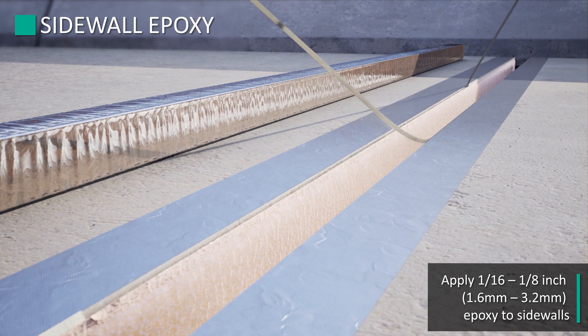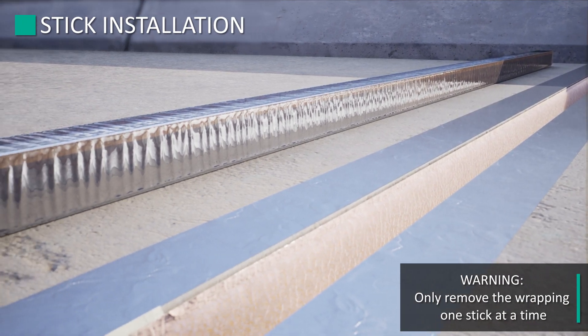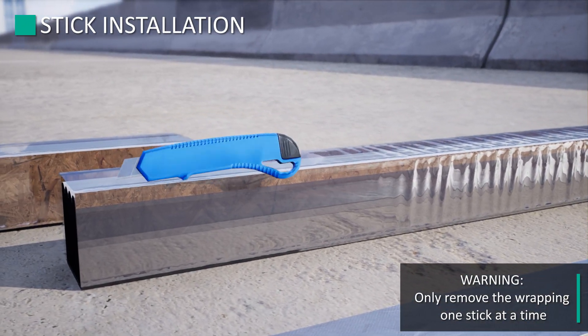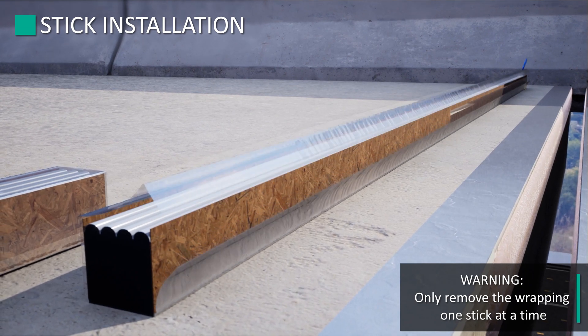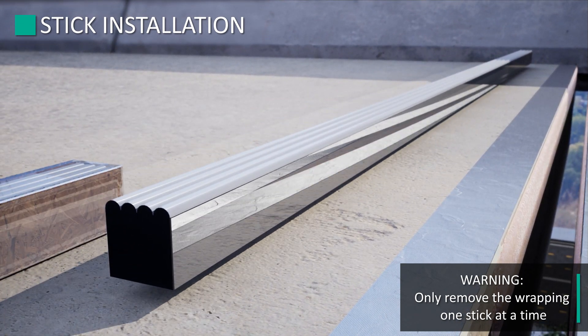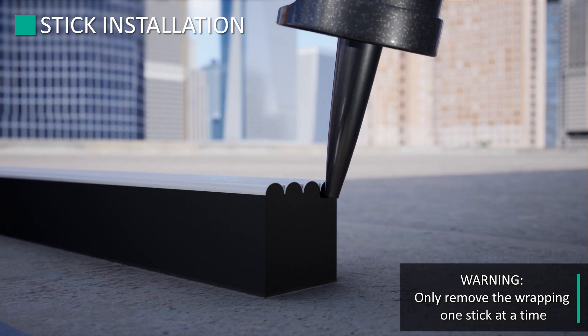Remove the quarter-inch tape from the inside of the joint for the length of the first stick. If the epoxy hardens on the surface of the substrate before installation, another coat of epoxy can be applied within 2 hours. After 2 hours, the substrate surface must be abraded to eliminate the amine blush that occurs during the final cure. Prepare WillSeal 250 Stick No. 1 at the installation site. Remove the outer shrink wrapping holding the foam material in compression by cutting along the face of the compression board. Take care not to cut into the silicone face. Once the joint material is cut out of compression, it will begin to expand. Remove the compression boards and release film immediately. Thoroughly butter the butt ends of the stick with the supplied splice adhesive.